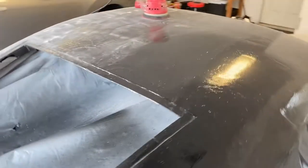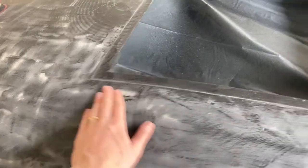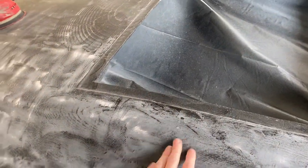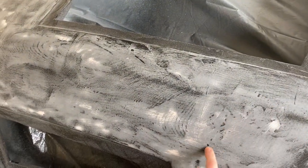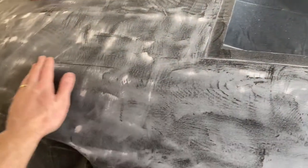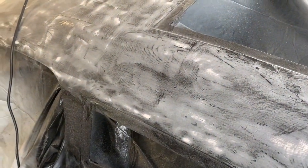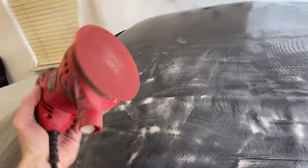It came out pretty good. I've started to sand this half of it, trying to get all the low spots out. I really like this gloss black color because all the shiny spots show through where it's a little low. When I get all that matte it'll be ready to move on to the next sand grit. Right now I'm using a 120 orbital.